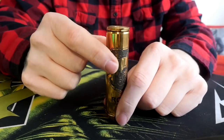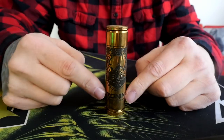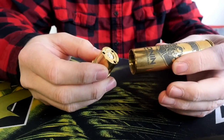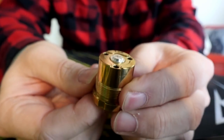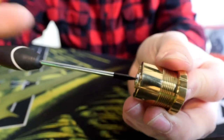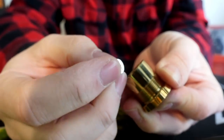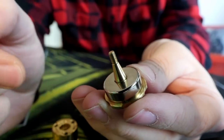Naval brass top to bottom, 510 hybrid connection, 25 millimeter diameter overall, with a silver-plated contact in the bottom. Let's pull this switch out — it's a big beefy switch, and the threads on all of this are beautiful, nice buttery smooth threads. There's your switch, there's your contact that's going to come up and hit your battery, and you've got vent holes in the switch as well.